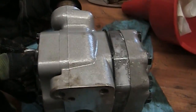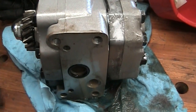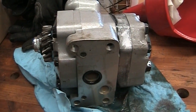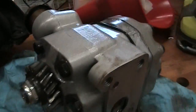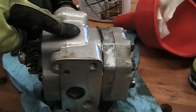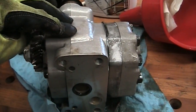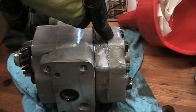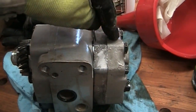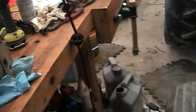It's hard to tell if the pump is bad by feeling it, listening to it, or looking at it. It doesn't take much for it to be burned out — I know it did get starved of fluid and was making a lot of noise. This is the hydraulic pump side that operates the lift, and a portion is diverted to the power steering cylinders as well. This is the draft control — they also call it the Hydro-Touch system on these old International tractors. I bought two of these pumps and the grand total was about $800, hoping that solves my problem.